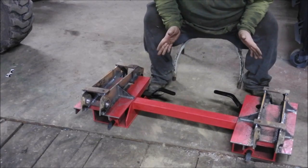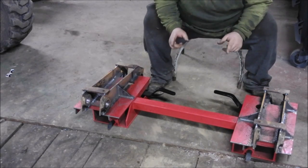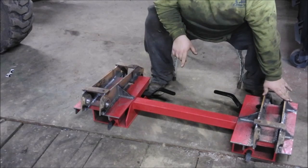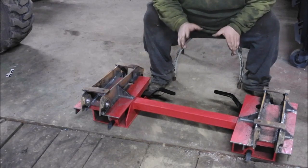Here's the plate that attaches to the tractor. We actually tacked up everything — we cut it off, trimmed, and tacked everything into place while it was still on the tractor; we never took it off that way. The spacing of this thing stays the same, the angles — we can make sure everything was square, that it hit the stops where it was supposed to hit.